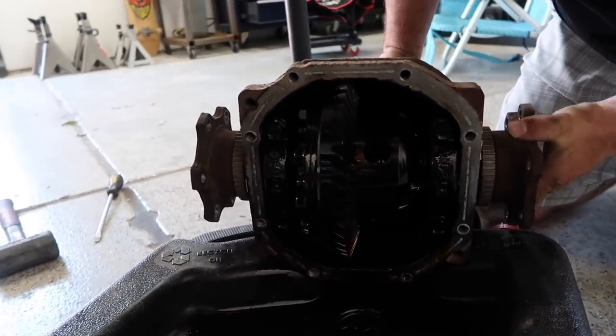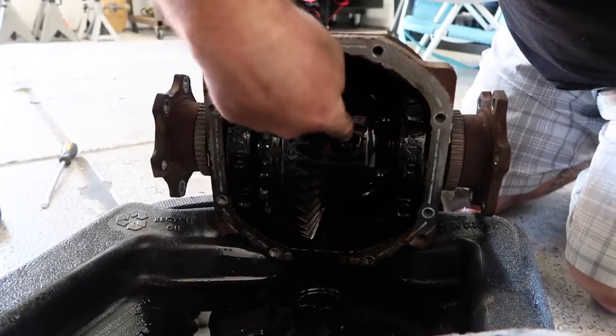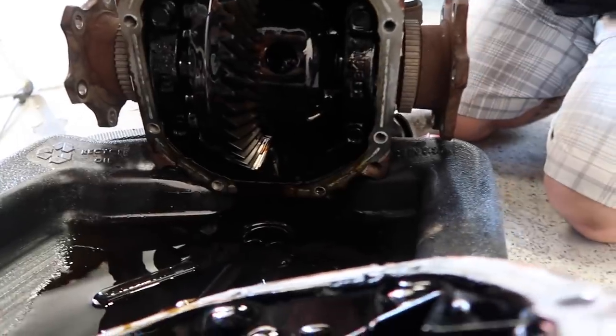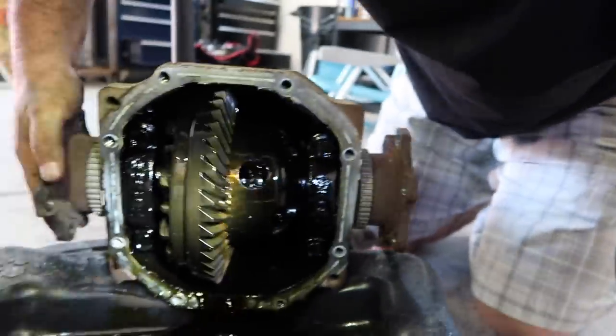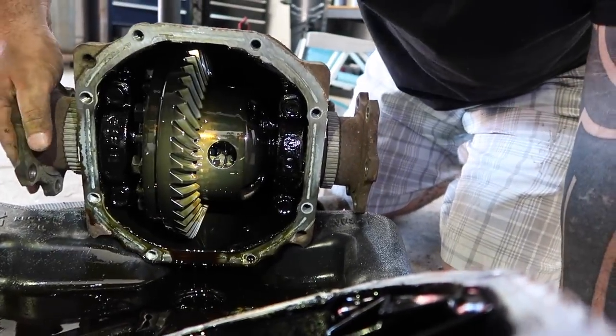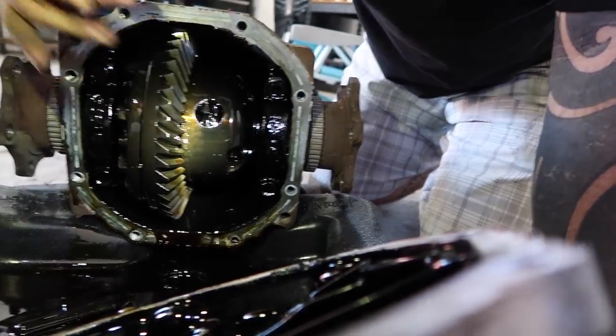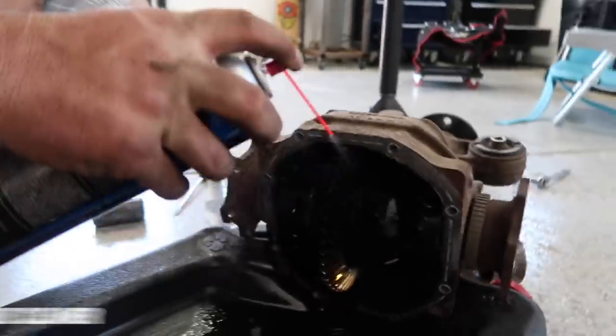So can you point it out, or do you have to pull the middle part out? See those gears inside there? Grab that flashlight. It's a limited slip, so I'll have a spring. Yeah, I know that, but usually the hole is bigger so you can get weld right there. You don't have to take anything apart. So what you're welding are those gears inside here. Still weld them.